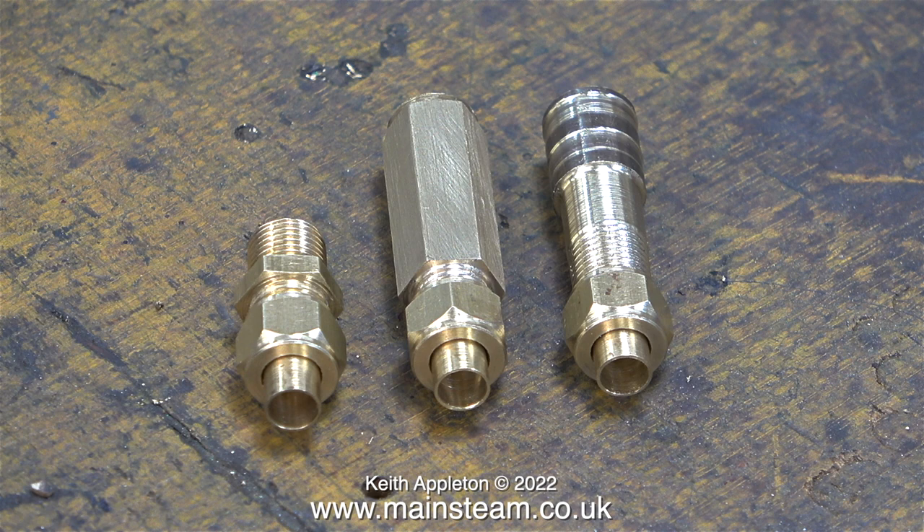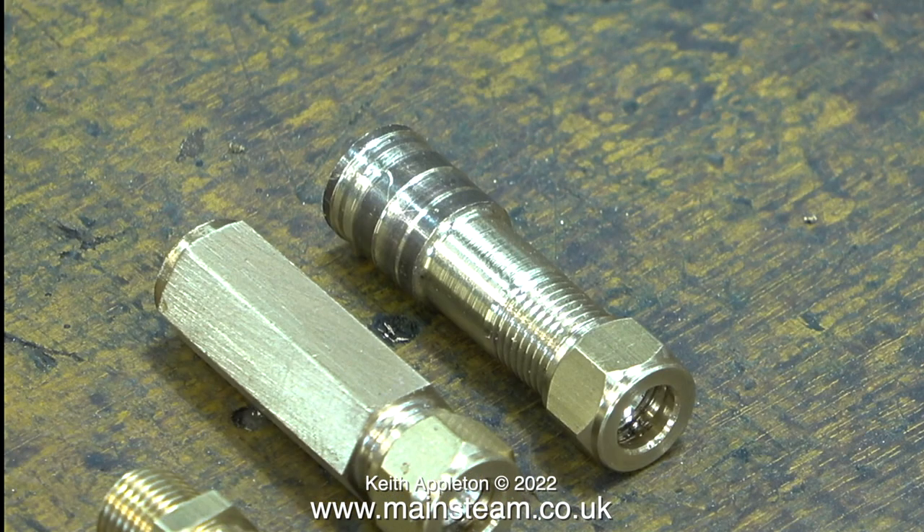I made the other two, though I didn't really finish them — I just made them for the video and I'm going to leave them this way because one day I will need to make an adapter. With the physical size of these fittings I have a choice: I could make an adapter down to quarter by 40 or quarter by 32.